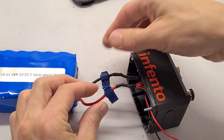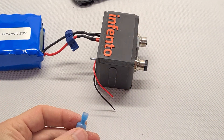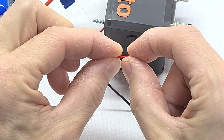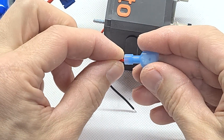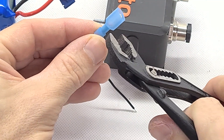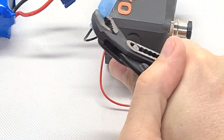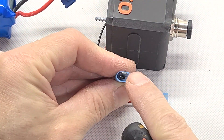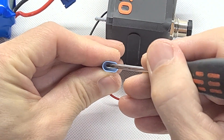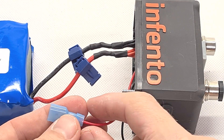Make sure you hear the clamps lock with a slight click sound. Congratulations — you just managed the hardest part. Now we have to crimp the connectors onto the small wires coming from the indicator panel. Bend the soldered ends of the cable and insert the whole cable end, including part of the insulation, into the connector. Crimp the connector's end firmly and make sure the cable is held tightly. We can now plug the connectors into the terminals — this turns out to be quite tricky. You may need to bend the metal tongue inside the connector back into the center so it slides into the slot of the terminal to create the electric connection.